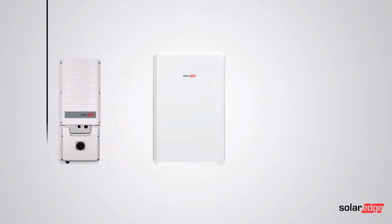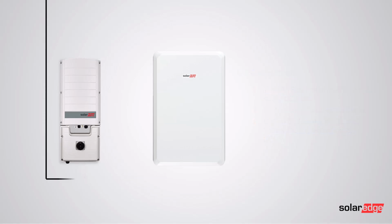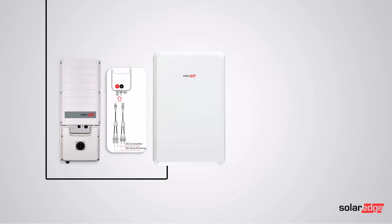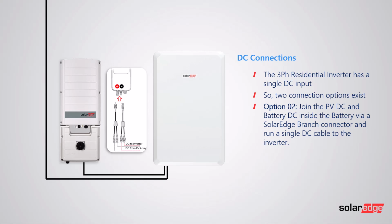There are two options to do the DC. If it's an existing installation, you'll already have the DC coming down from the roof to the inverter. For that, you'll need to join the battery DC in the DCD before it goes into the single input into the inverter. The alternative way to do it, which is really ideal for a new installation, is you take the DC straight to the battery and then use one of our branch connectors and take that single DC connection through to the inverter.